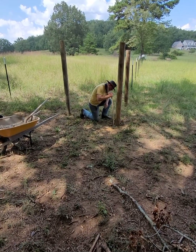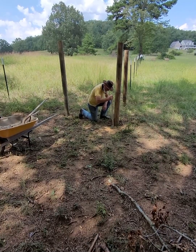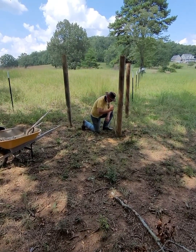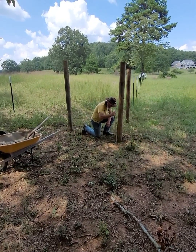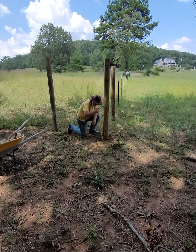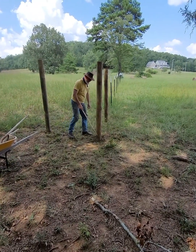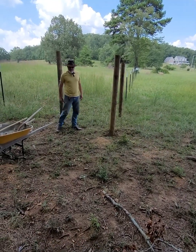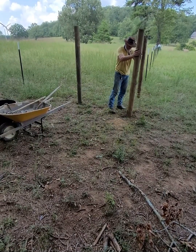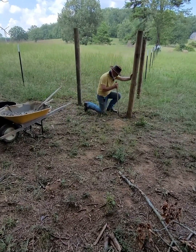As I was tamping, I noticed that it didn't seem to be using as much concrete as I had expected. It seemed to be filling up a little more than I would have thought. I wasn't sure that I was getting into all the spots there where those armadillos had burrowed out. When I started to work that post, I could see that concrete flowing as I moved the post around.